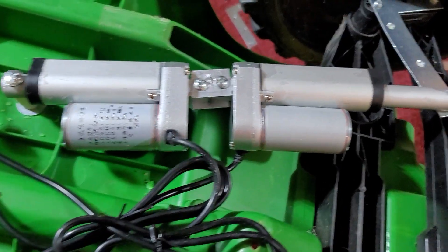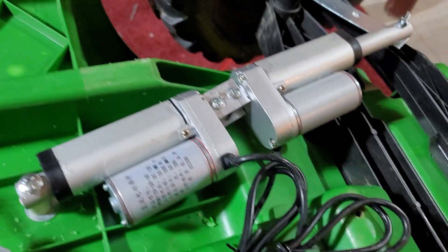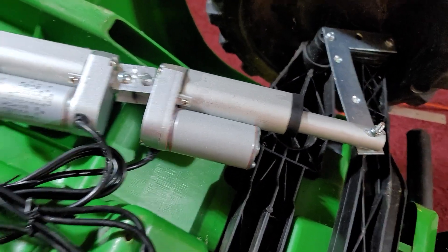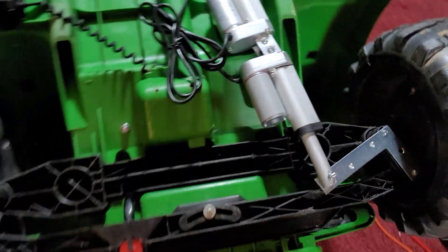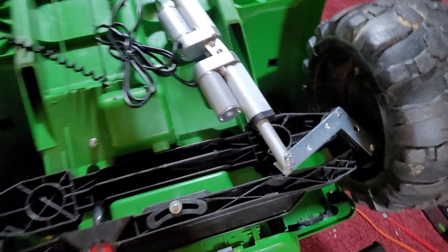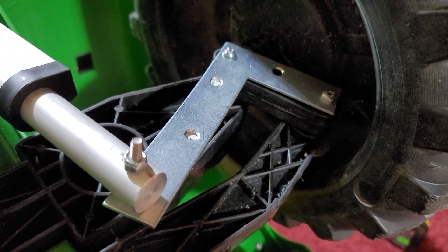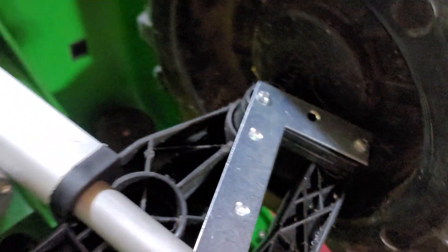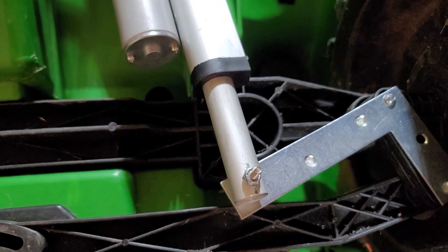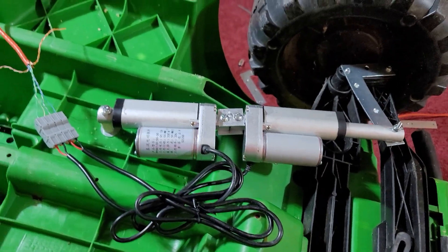The other thing going on here is you have two 2-inch actuators strapped back-to-back. What I've done is have one rest retracted and one rest extended in the steady state. This configuration represents the center position of the wheels' steering. I've also mounted L brackets — flat L brackets — cut perfectly to length to give you the angles you need for leverage to push the steering linkage.